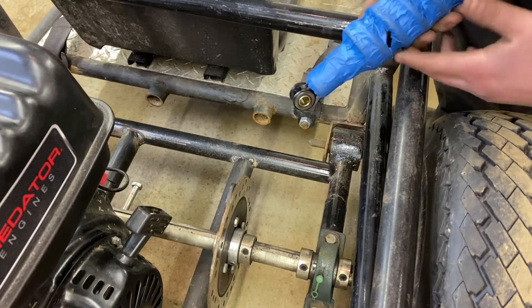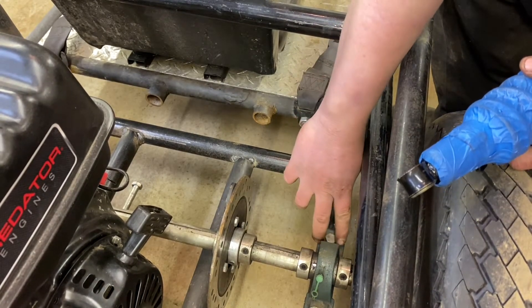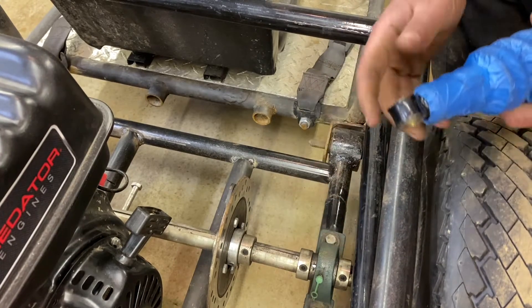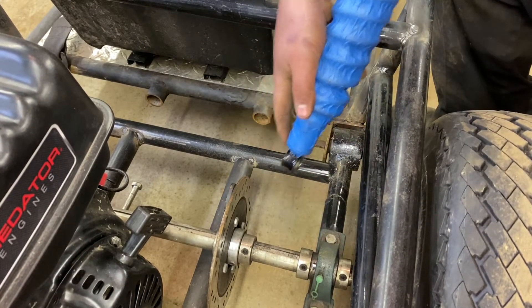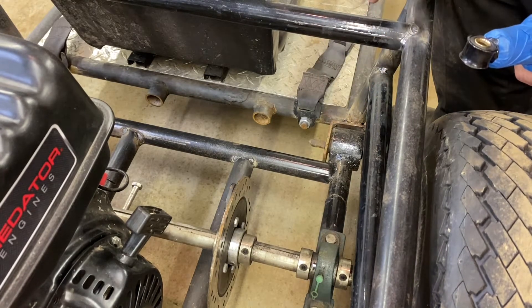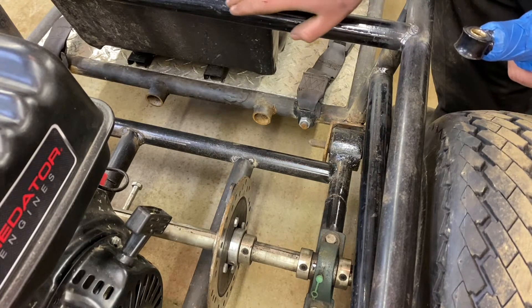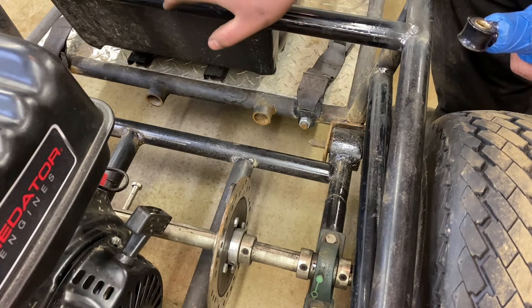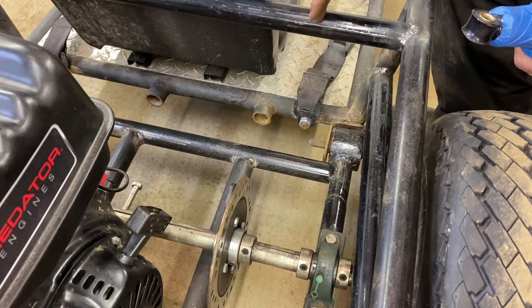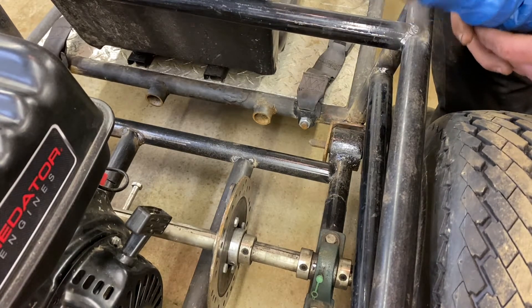These will be linked in the description below, so I'd like to give you that warning before you think about buying them — they are pretty robust springs. My first idea for mounting was to use the bolt down here to have a hanger come up to bolt the lower half of the shock in, and have the upper mount go right in here because this is a pretty strong point. The farther you go out, the weaker it gets because there's not much support.